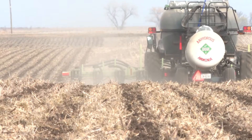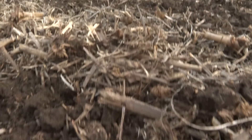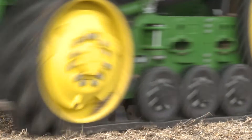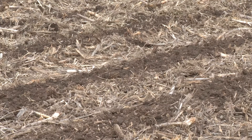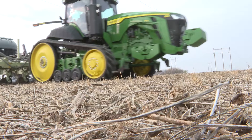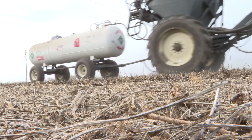He says managing compaction is vital to good root growth each spring. Natural compaction occurs below 12 inches deep and we're never going to do anything about that — what we can manage is that top 12 inches. A typical disc type of tillage will create a compaction layer between 3 and 8 inches deep. I want to set that shank just half an inch below that compaction layer, create a lifting effect, shattering that compaction and creating a nice trench for that seed to promote root growth, flourish, and capture those nutrients within that strip.